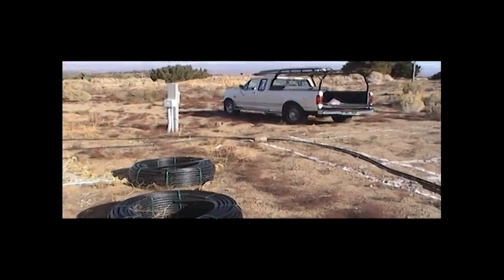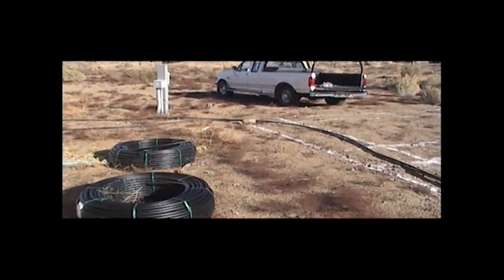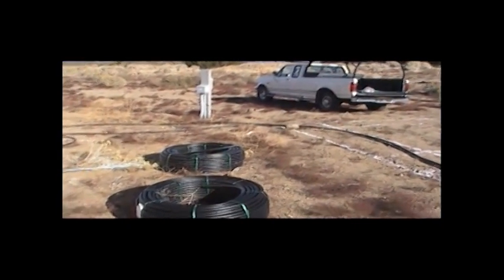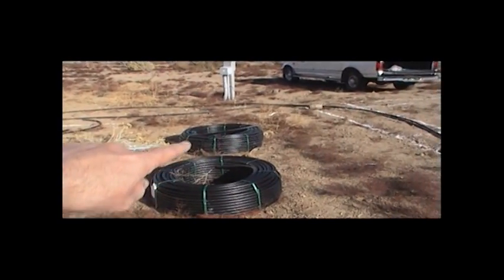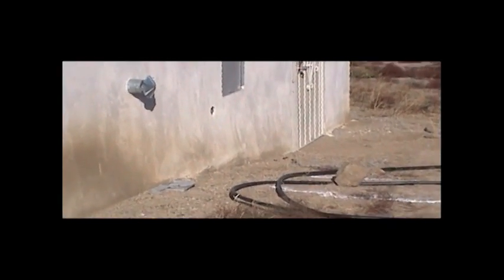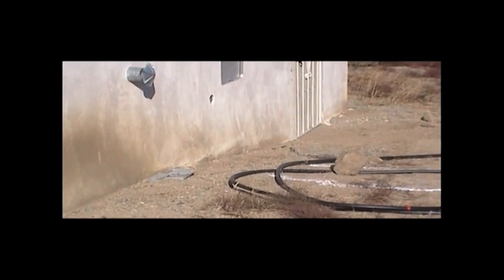This is Saturday, November 26, 2011, and I'm going to show you the layout and eventually the installation of our geothermal heat pump system. Last Monday all the equipment arrived from Ingram Water and Air, got offloaded, everything was undamaged — free shipping, which was nice. We've got the coils, and we're going to have four trenches. It's a three-and-a-half-ton unit, so we'll have four trenches. The manifold will go right in this spot and enter the house through a small hole into the crawl space, where the heat pump will be installed.